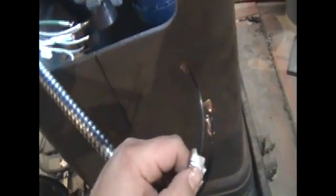I sure hope I marked these leads right coming off the motor. It's only four leads, but T5 and T8 are the ones you use to reverse it. You need T5 with T1 and T4 with T8, or T1 with T8 and T4 with T5. You can't have T5 and T8 together — they have to be with the opposite two wires. I'll get that wired today and hopefully fire it up pretty soon.